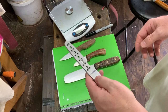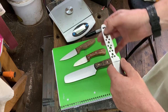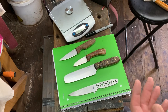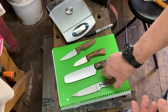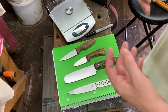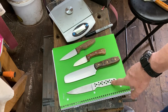With this being the prototype, I'd probably just go ahead and leave this full tang. Once I hollow this handle out — put the fuller in there — after heat treat I wouldn't have to do a whole lot to have the handle ready to put scales on, other than make sure it's true and flat and cleaned up. I also have to consider what type of handle material I'm using. If I know I'm going to put a heavy handle material on there, I need to either remove more steel from the handle or possibly taper the tang.